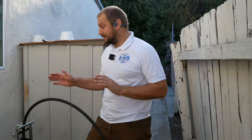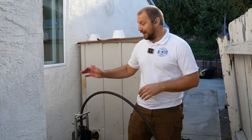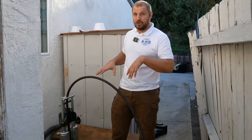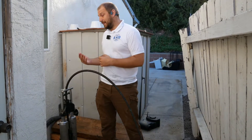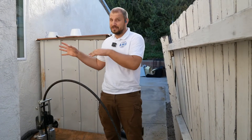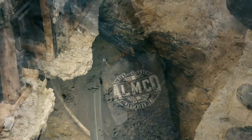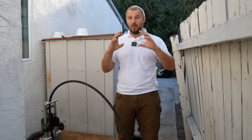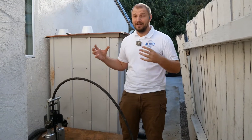Here's the kitchen and here's the pipe bursting equipment. We tried to pull it and reset probably four or five times yesterday — it doesn't go. We think it's wet dirt and the equipment is just pushing the dirt. We tried tunneling from the bathroom to see where the head is stuck. We're guessing, but the next step is going to be digging in the middle of the living room. This is something that can happen with pipe bursting — if something is blocking the way and you can't go through, the only option is to break the floor, dig, and see what's there.